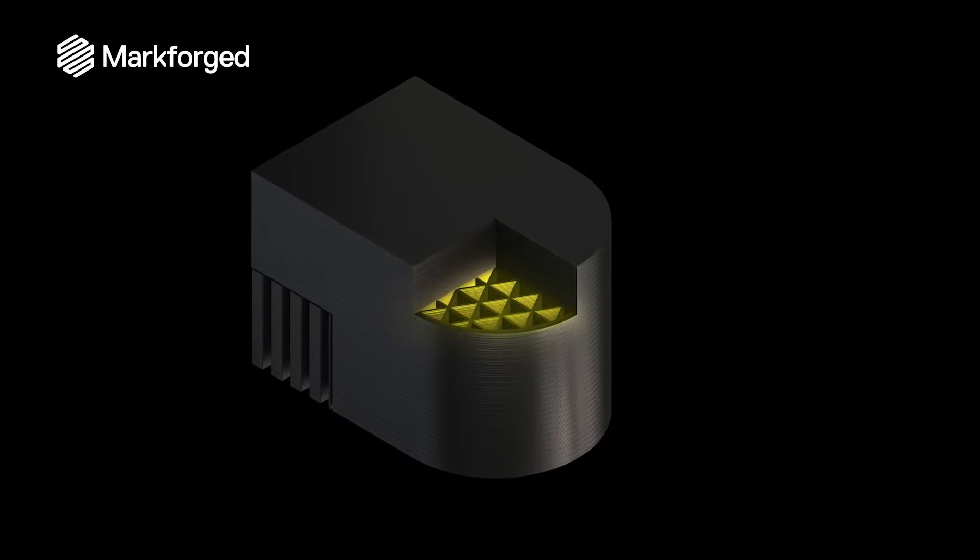While it seems unintuitive at first, there are two reasons 3D printed parts are not solid. First, closed cell lattice infill saves print time, cost, and weight in parts. Second, it mitigates distorting forces like warping caused by unequal cooling.